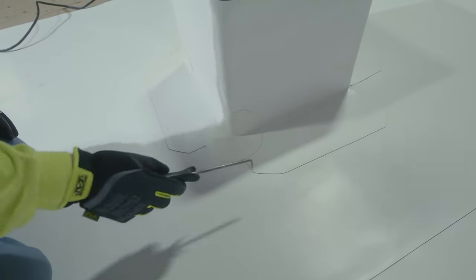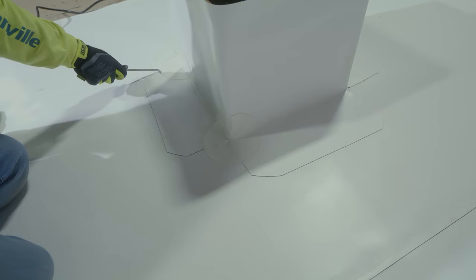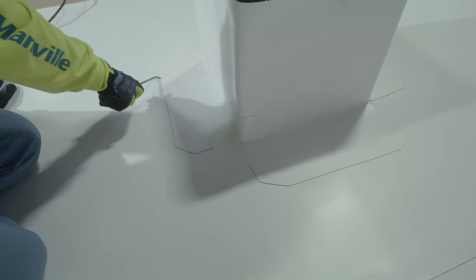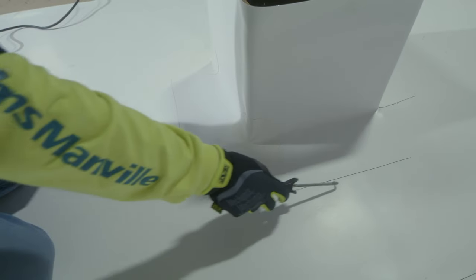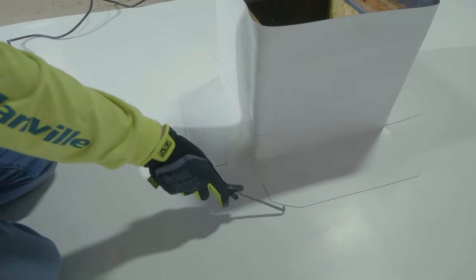After our corners have been installed and everything's welded, the last step we need to take is to probe our welds after they have cooled properly for about 15 minutes, and then to apply cut edge sealant as required to any cut edges we've made in reinforced membrane on our flashing.